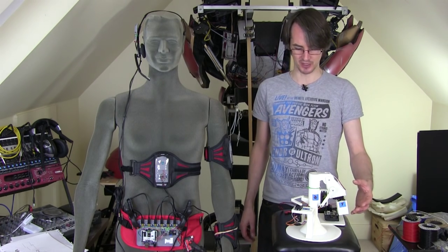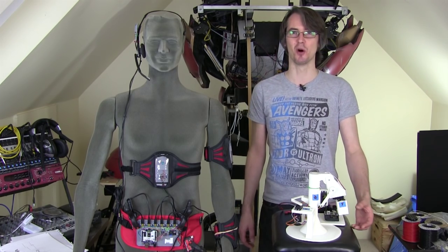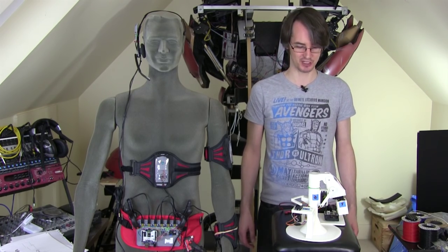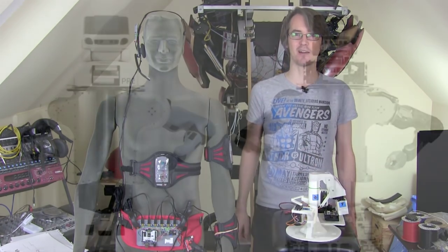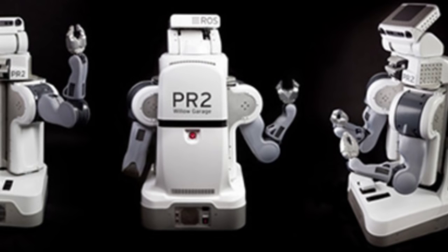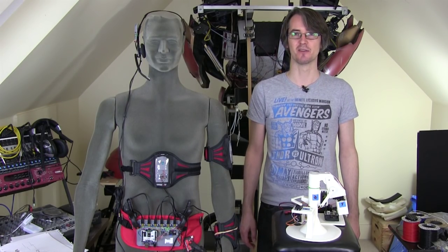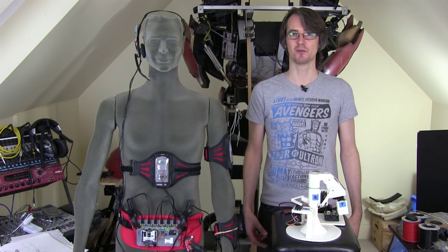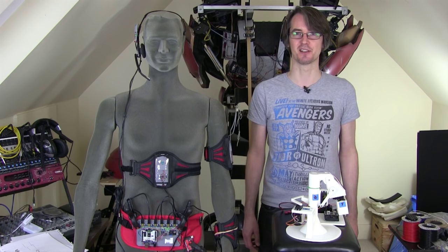So having looked at this arm that I've actually built by looking at Euler angles and then going and working out how I would apply them to a robot, and then looking at commercial robots, I've actually found there are commercial robots that work in exactly the same way. So if you have a look at the Willow Garage PR2, which is a very expensive commercial robot that's mobile with two arms, and it does all sorts of fantastic stuff. In fact, its joint configuration is exactly the same, and it's missing that fourth axis essentially. So it would work in exactly the same way that I've described. And that probably means that it works with Euler angles. So that's really quite interesting, having done this and then discovered that that's the same.